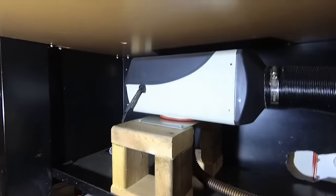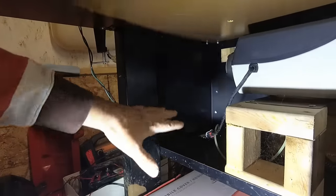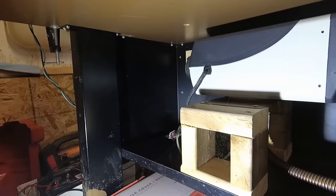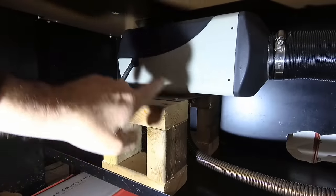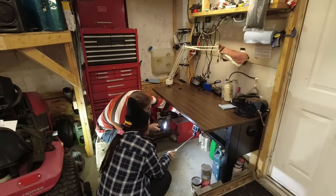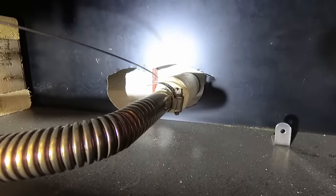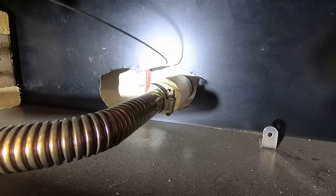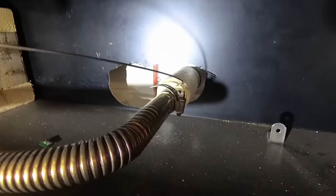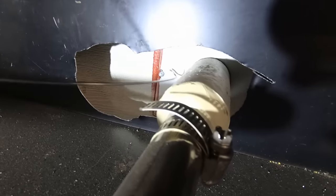I installed it here on a metal desk, inside, and use that as a workbench. Because the exhaust comes out of the bottom, I lifted it up on some cut two-by-fours. I made my exhaust right here — it's two pieces of pipe, one on the inside and a larger one on the outside, insulated in between with rock wool. I welded it with a washer spacer on each end and used high-heat JB Weld to make sure everything was sealed.